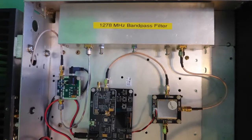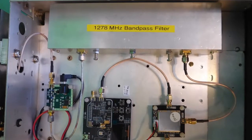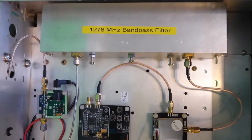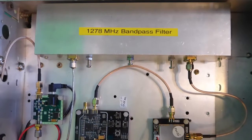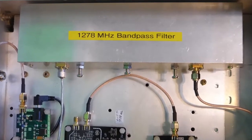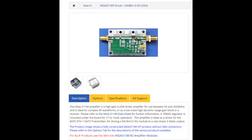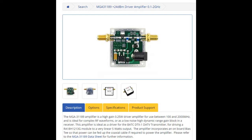The mixing process not only results in the wanted output frequency, but other undesired frequencies that should be filtered out. This is the three pole bandpass filter that I've made, and we'll leave a link below to the video showing its easy construction. You could use a SAW filter, but I haven't tried one. The output from the modulators is typically 0 dBm, which is not sufficient to drive a final power amplifier. Shown are preamplifiers that have quarter watt output. Suitable other ones are available online.